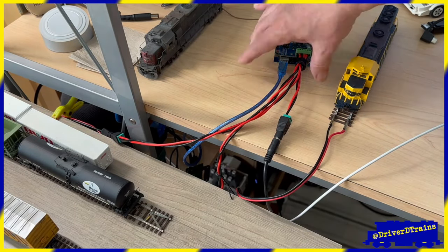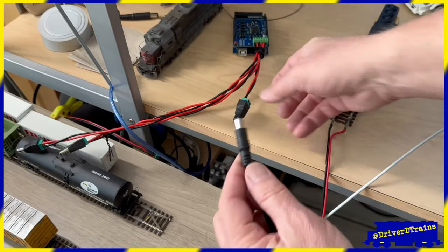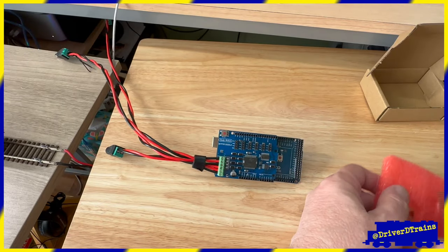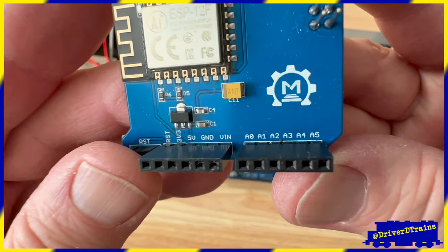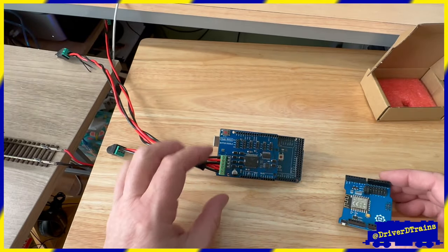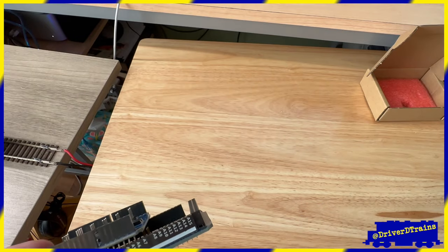First, before we start, make sure you unplug the USB cable and all the power leads from the Arduino and Motor Shield. Now, get the Wi-Fi Shield and look at the top of the board to identify all the pin names along the edges where the header sockets are located. You will want to make sure that these line up with the same pins on the Motor Shield.